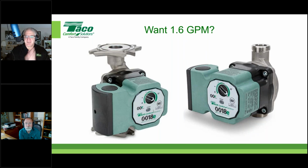Just remember, the circulator's not providing flow to the fixtures, all right? That's the street pressure. We've had that question often. This is, well, wait a minute, that 1.6 GPM or 3 feet per second, 2 feet per second, that's not enough flow to run two showers at the same time. The pump's not doing that. That's not the point of the pump. It's not a booster pump. It's not a delivery pump. If you didn't have the circulator there, you'd get pretty much the same performance in your system.